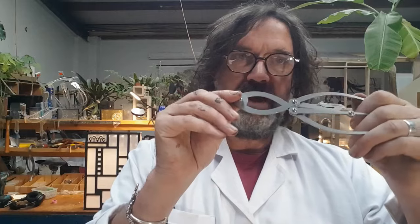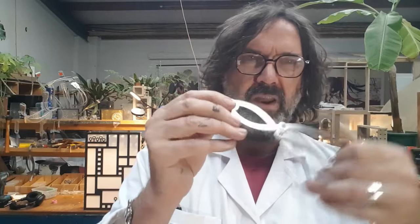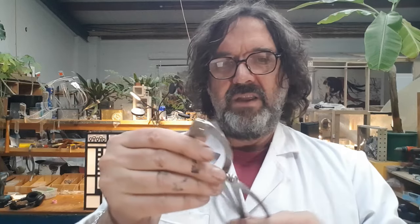They're made from laser-cut stainless steel, 1.5mm thick, which is fairly solid. I was making them thinner, but they need to be quite solid. They are polished in a rock tumbler — a similar process to the way gemstones are polished. It takes about two days, but it gives the best finish by miles.